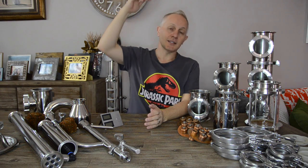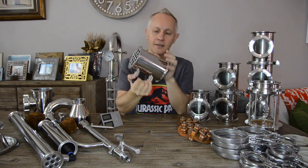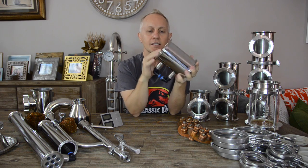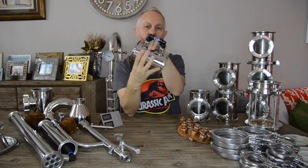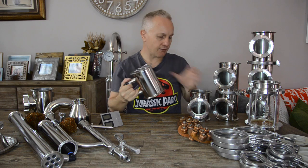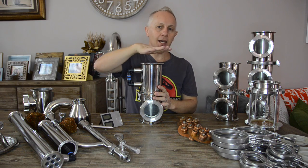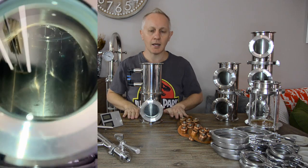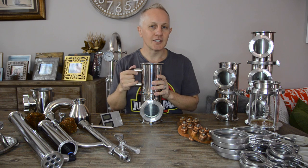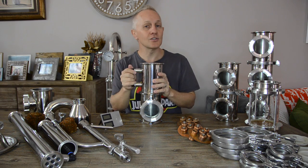From the 4-inch when I build up my tower at the top, I've got my reflux condenser or dephlegmator — it's a shotgun type, as you can see with all the different holes. Your cooling liquid flows on the shell side, and on the tube side will be the vapors you want to condense. This one sits right at the last T-section at the top and acts as a reflux condenser to push liquid back down. Sometimes I actually just use it for height — the condenser is quite long, so I add the dephlegmator just for height without connecting the water at all.